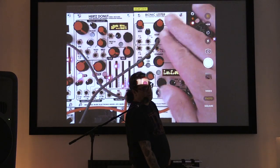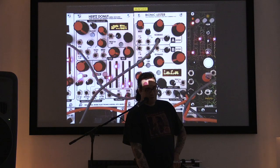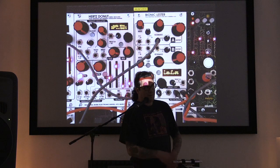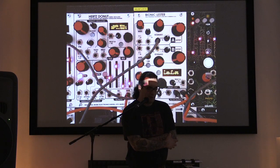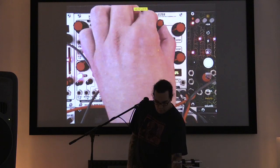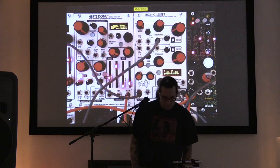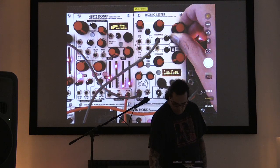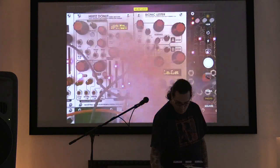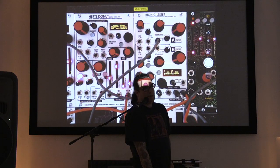When you turn this resonance control past the noon position, it switches to negative feedback, a slightly different class of effect, but with similar behavior. The positive and the negative feedback processes often select different portions of the input signal spectrum to develop into shifting waves of feedback. As you take the feedback to the maximum, that is where we again get the developing self-cycling feedback.